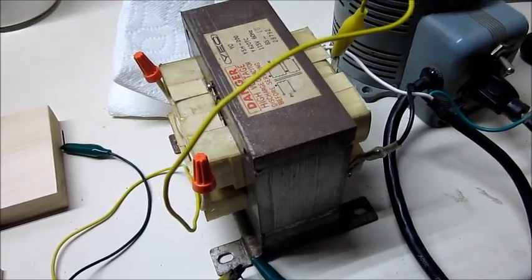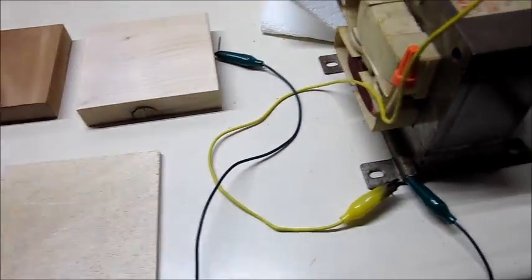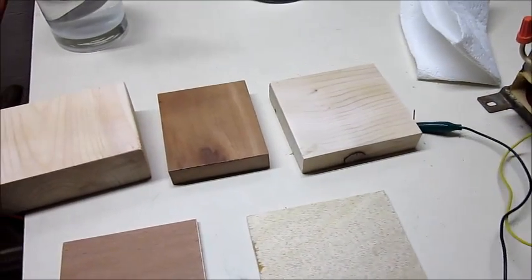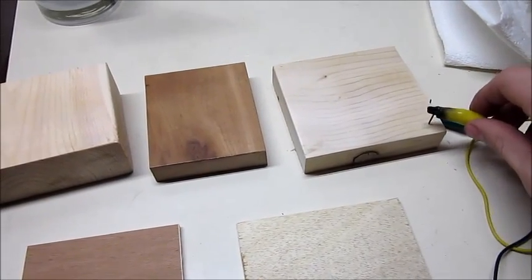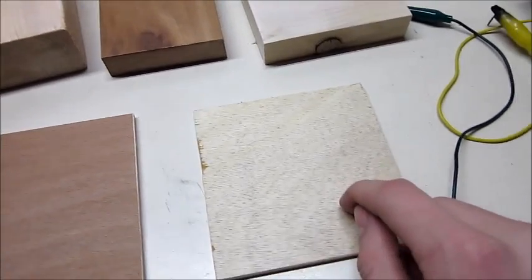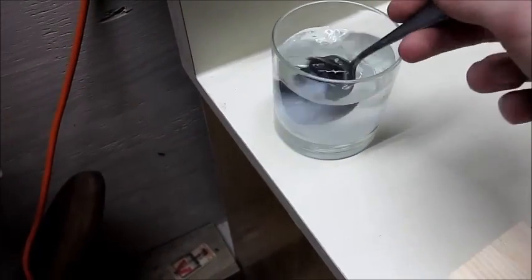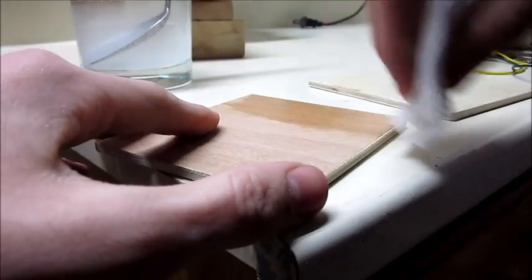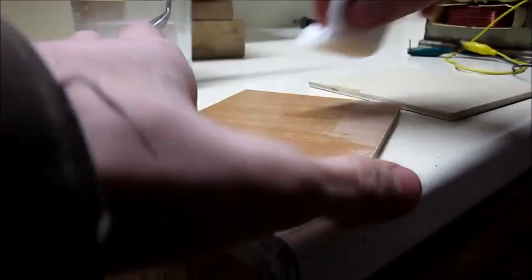The transformer is hooked up to the Variac which is set to 120 volts. Now the last thing you ever want to do is plug it in — don't do this at home in general, but last thing is plug it in. Next step: place the nails with the alligator clips into whatever desired position on the wood you want. I'm going to do mine on the corners. I'm going to put some baking soda water on it — the only reason for the baking soda water is to provide better conductivity in the wood. You can experiment with how much water and how much baking soda you put in.